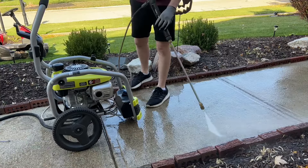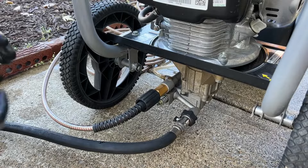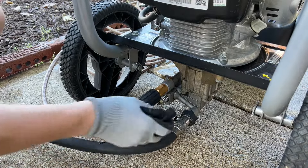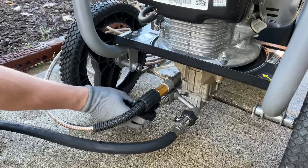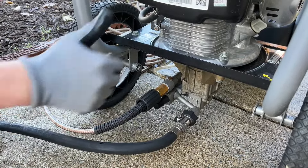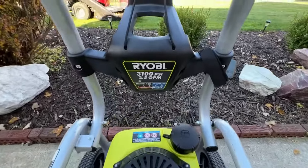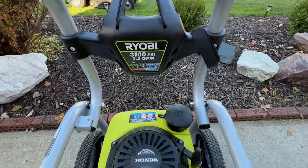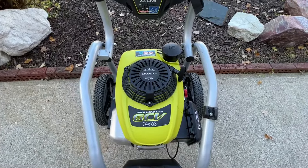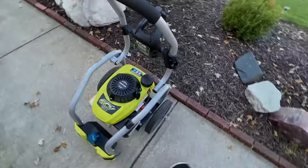At this point I was happy with the adjustments, so I'm going to leave it here. The only other things to do is make sure you have that jam nut tightened up and then put on the small black plastic cover, which just protects the unloader valve. Thanks for watching — if this video helped you out, feel free to subscribe and like the video, and check out my other videos with different repairs for small engine equipment.